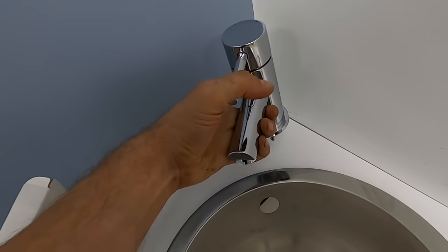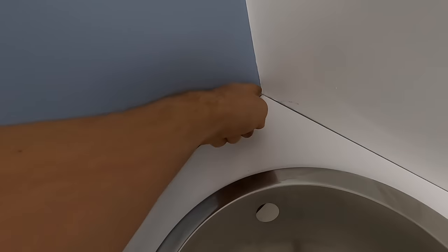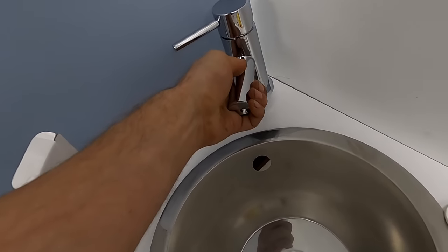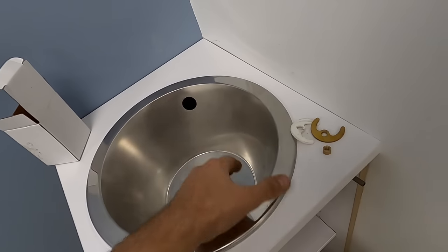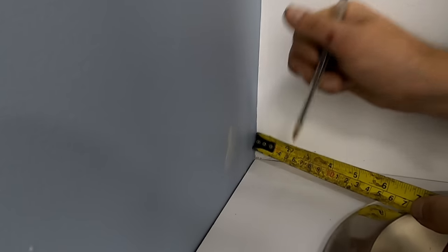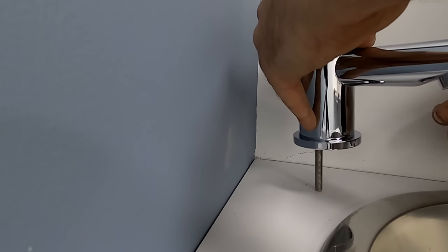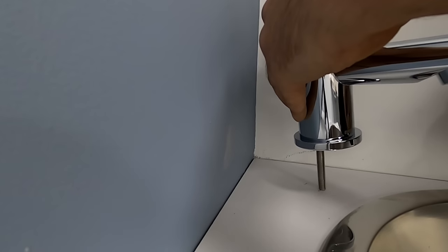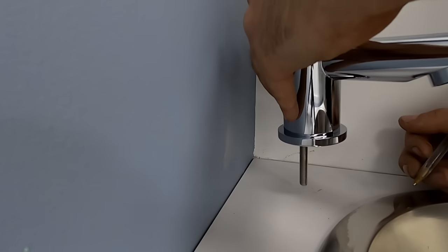What I'll do is centralise the gap - you'll still be able to open the handle. I'll just put it between the centre of there and there. I think that'll look okay. We'll run with that - even if tiled there's still going to be space. It's going to be at 140 so if we go about 80, that'll look about right. Just slightly further forward - about there looks okay. The hole will be big enough so we'll move across a little bit.